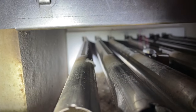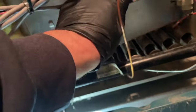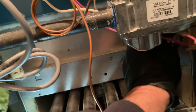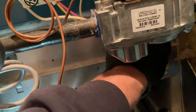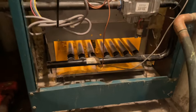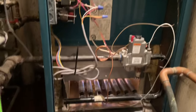These burner tubes are a bit annoying to get in — they have to go right into that slot. I'm putting the chamber cover back on, hooking up the wiring, reconnecting to the rollout switch. Putting that back to 'on' and turning power on. I'll let that cycle, and now I'll do a PM on this boiler.